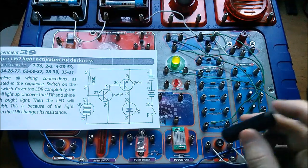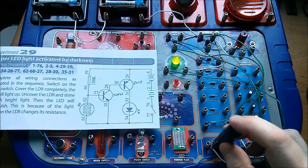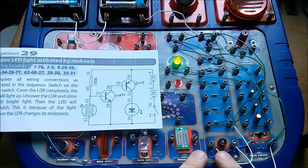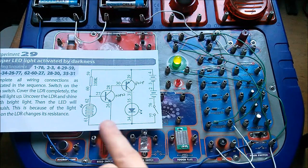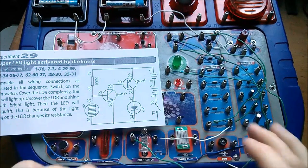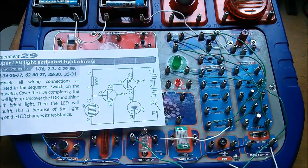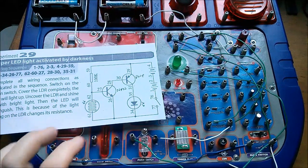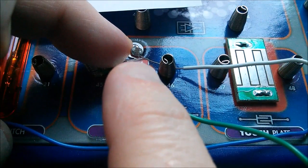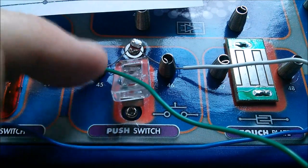The circuit doesn't do anything, because this is of course a diode, not an LDR. So it's a little bit naughty of this electronics set to be referring to this as an LDR. If you follow the numbers of course it works, but if you don't follow the numbers, well it doesn't work. Now I've just routed the wires to my actual LDR — getting in close because you can't really see it. Yes, it's here — you can see the characteristic zigzag line between the two electrodes.